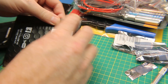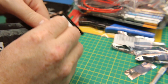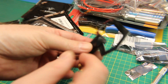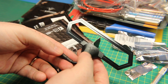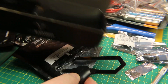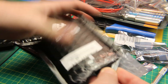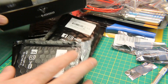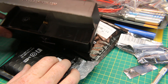I also ordered the TBS diamond antenna for the transmitter — your ground station, the radio you hold in your hand. This is an almost perfectly omnidirectional antenna from what has been tested and proven. Plug that in and it gives you a great pattern in just about all directions. The antenna that comes in the box would be just fine too, but since I was ordering, I figured I might as well get the diamond antenna. Now I've got enough to switch multiple quads and multiple planes over. I just need to do the mod on my QX7 radio to replace the transistor, and then it'll be capable of talking Crossfire.